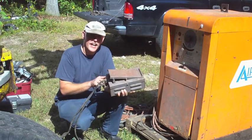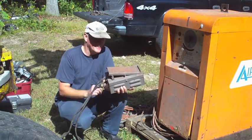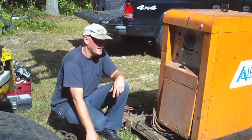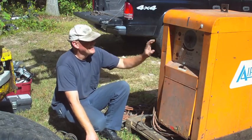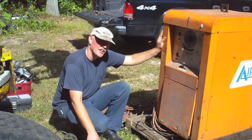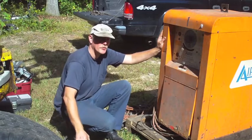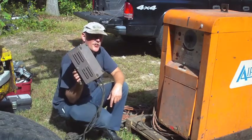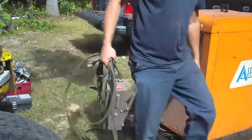I'm going to have to do that to both pedals — I'm keeping one and want it in good working order, and selling the other one in good conscience. I don't know a lot about welding, but I know a lot about electrical. I've read on several welding forums that more than once a good old transformer welder like this has been thrown out and thought to be defective, when in fact the problem was in the pedal. If the pedal is dirty it needs to be cleaned and serviced — you'll think something's wrong inside the machine when it's just the pedal.